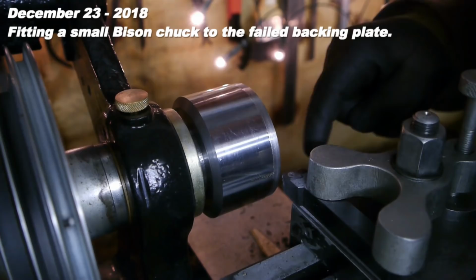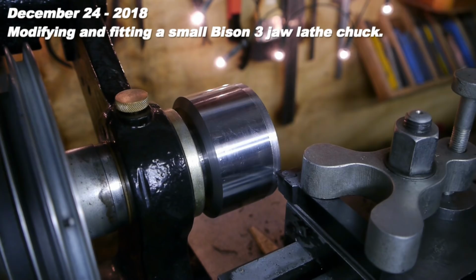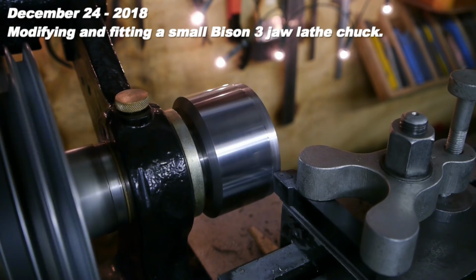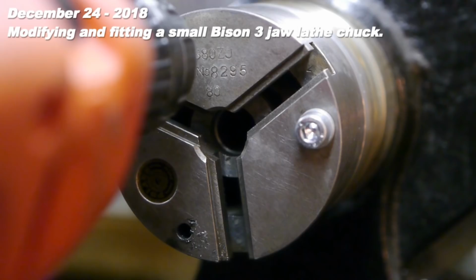And I think we lost the tip. I think there's a small piece missing there. It's hard to see. Yeah, let's try it again. Why not? Make it a lighter cut. Back to 400 RPM. Yeah, that best of cuts terrible. That almost went sideways.